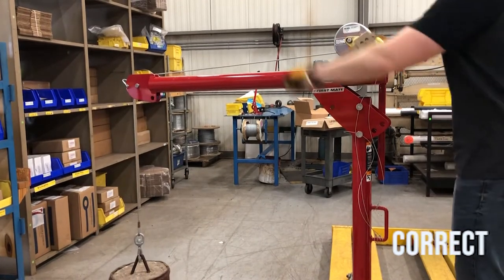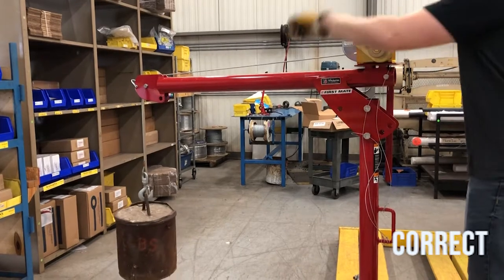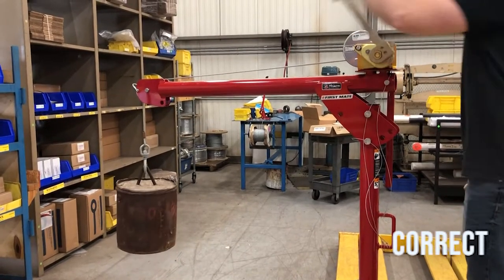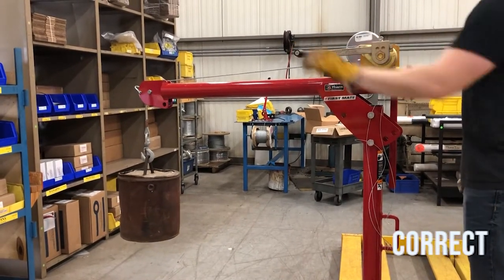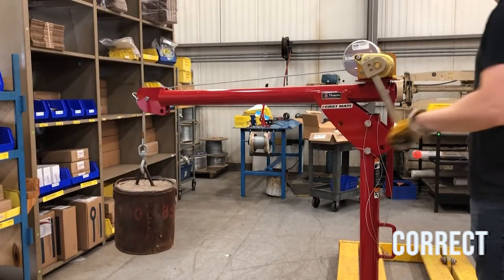The brake consists of a bolt, nut, two friction discs, and a ratchet wheel with pawl. The bolt and nut sandwich the ratchet wheel between the friction discs. Turning the handle in the up direction screws the nut onto the bolt, compressing the friction discs and ratchet wheel so all components turn together.